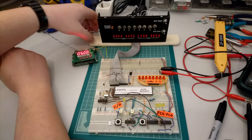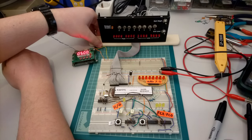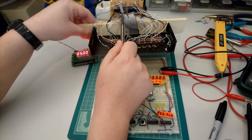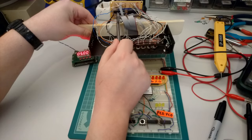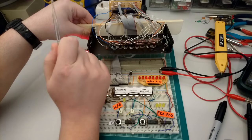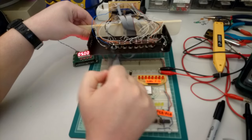So obviously this switch box is not just a bunch of switches connected to the data lines directly. Rather, I'm using a pair of 8-bit latches. Each of these latches is actually a series of 8 D flip-flops. However, they have the crucial ability to disconnect their output from the rest of the circuit.